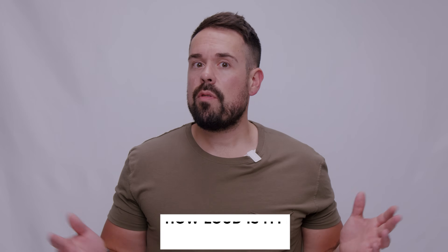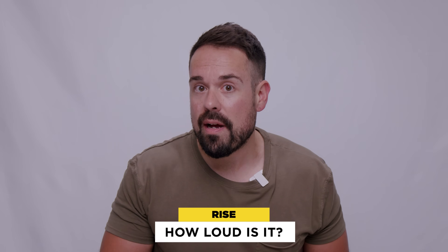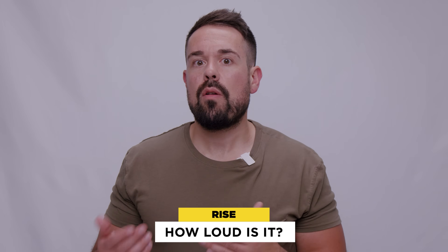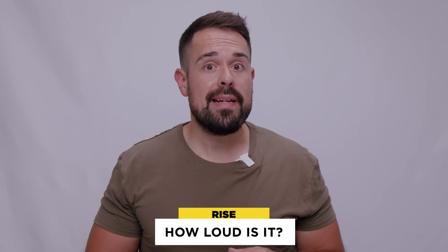How loud is it? Well, this little thing does a lot, so it's understandable to expect it to be really loud. It's actually surprisingly quiet since it's really just a fan, a filter and a ceramic core. When you're standing 10 feet away from the TwinFresh Expert it produces 0.2 sones at the slowest fan speed and up to 0.5 sones at the fastest. One sone is the sound of a whisper or a refrigerator running, so the TwinFresh Expert really delivers as far as noise is concerned.